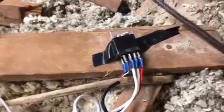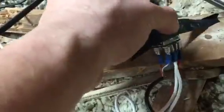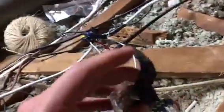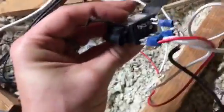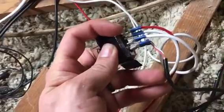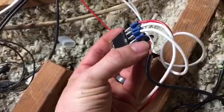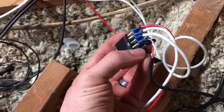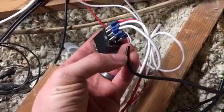Okay, now I used a double pole, double throw relay switch, but I probably only needed a single pole, single throw relay switch, because you only need your up. Okay, I'm gonna start from the bottom again. There is your 12-volt trigger, or coil, as an electrician referred to these bottom 2 as coil. It is your 12-volt trigger.